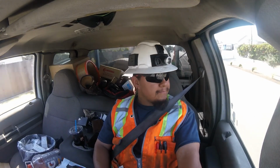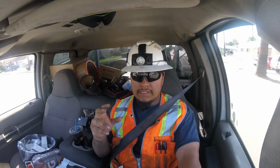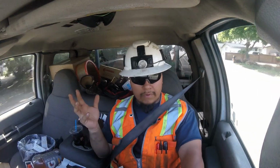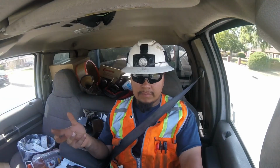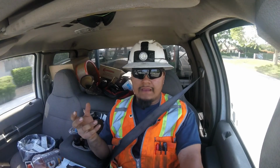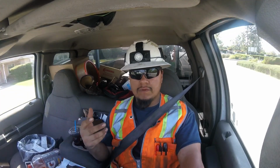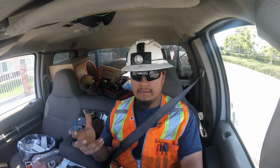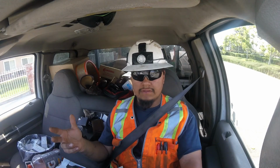But, you know, I really don't like that Mate did away with the sensor entirely. The way they look at it is that they got rid of the low oil level sensor, but they still have a high temperature sensor. So if the machine does run low on oil, it's going to cause the machine to run hot. If it runs hot, there is a temperature sensor to kick it off.